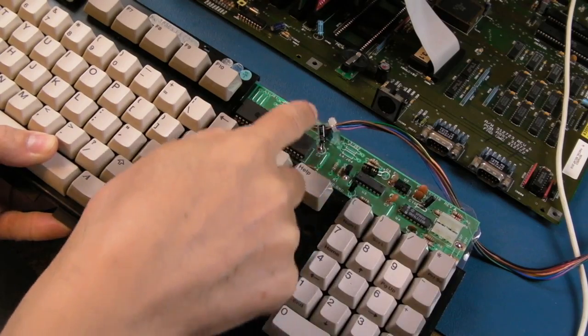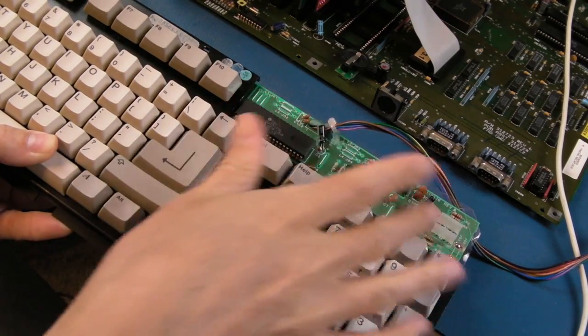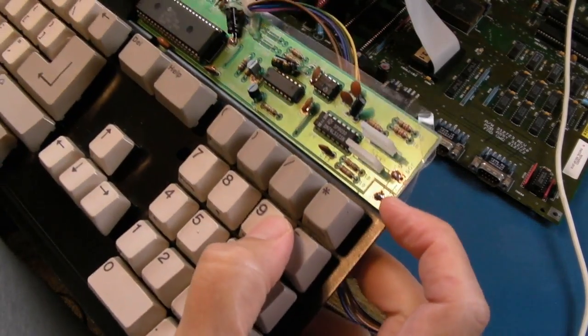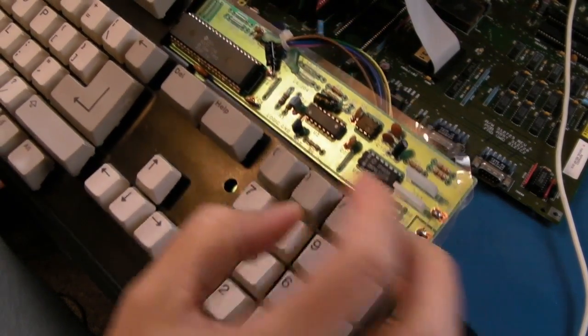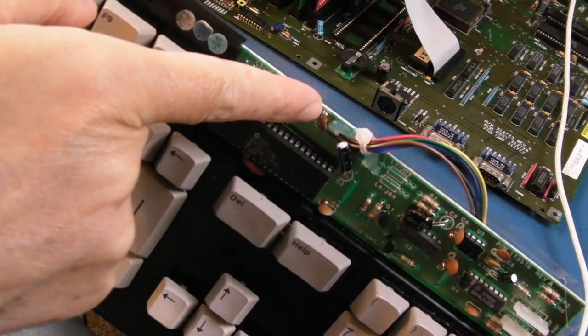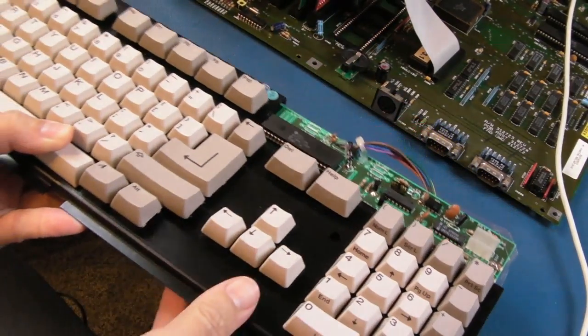Anthony swapped the main chips, he's recapped this. We've got some, like I say, sort of 4 or 5 different traces that are damaged but have been patched. Solder points here, yeah, they just need a bit more flux in places. There's 2 caps here that, well, it's almost shorted, that cap, as it's got folded over. Could have happened in transit. But I don't think that's going to be the issue.